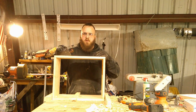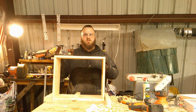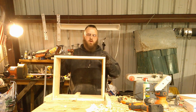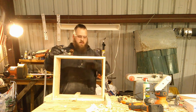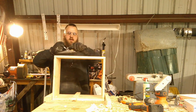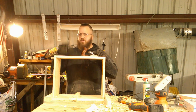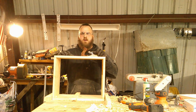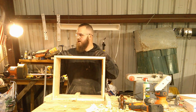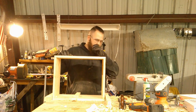The reason for that middle hold down and setting it up like this is so when I check these boxes and make sure they're good and square, when I put my telescopic covers on, if one side, like one corner, isn't quite going on nicely, I just do that, make sure my screws are ran down far enough for the blade won't contact, and then I just whoop, whoop, on the corner that's giving me fits. Got that all done. All my telescopic covers should be perfectly fine. Now, they were all made the same exact way. These boxes I made at different times just probably caused an issue with that in the long run.